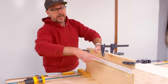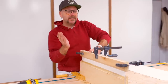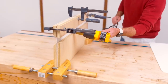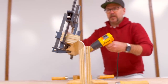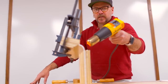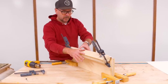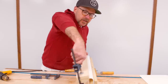This keeps the plastic from warping as we heat it up. I'm going to heat up both sides, and as soon as it gets a little bit flexible, I'll put a little pressure on it and over-bend it. I want to go to 90 degrees, so I'll probably go to about 93 or 94 because there's going to be some spring-back. It's bending on its own now and the weight of the clamps is helping. It's been about four or five minutes — it takes a little bit. Oh yeah, it's drooping now, so it's probably good enough. I've got to go past 90 because of that spring-back. We'll let it sit for about 10 minutes, take the clamps off, and see where we're at.